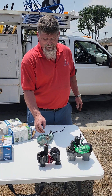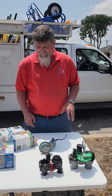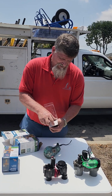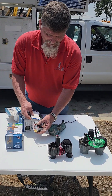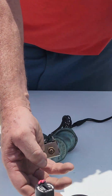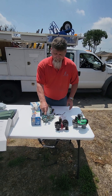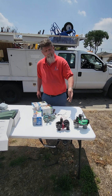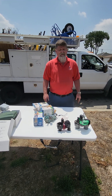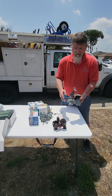Plastic valves are subject to heating up and cooling down much more rapidly than a heavy brass valve. The internal components are what fails — it's not generally the body of the valve. It's all the little rubber bits inside that fail. You can buy repair kits, but they don't sell replacement parts for the plastic ones — they only sell replacement bits for brass valves.